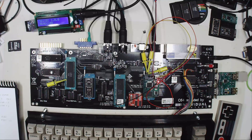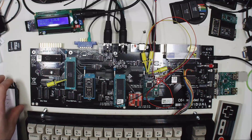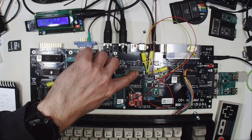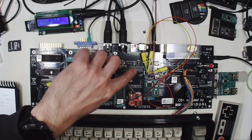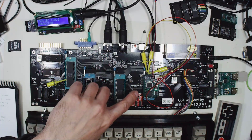If you have seen my previous video about the installation of the FPGA-SID, I changed the board right now. I moved on to the Reloaded MK1 board, and interestingly this board is fully prepared to work in a two-SID mode. As you can see, the configuration or the wiring is a little bit different. There is a kind of a jumper or socket on top of the SID socket where we can access most of the things we need for running the FPGA-SID in stereo mode.